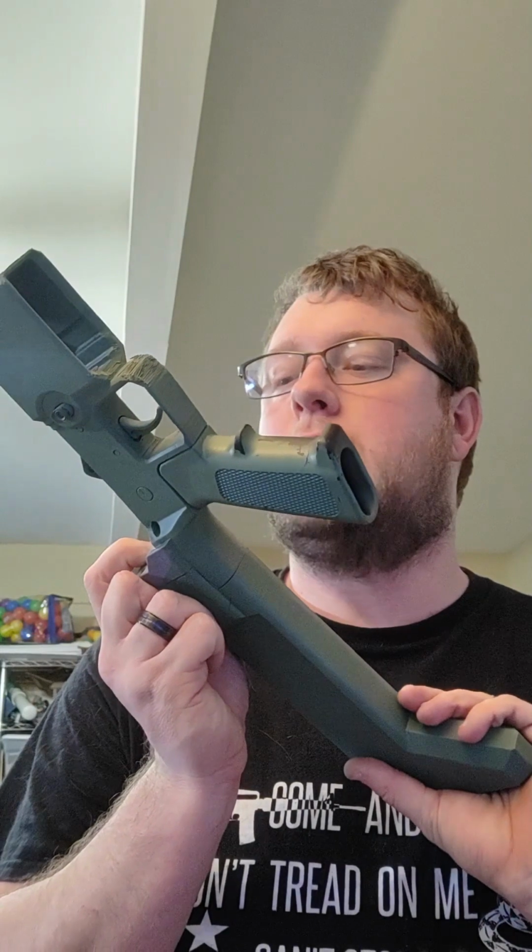All right, so first, our lower failure points observed are the rear takedown lug split. The stock design with the metal reinforcing and such was actually just fine. And I think increasing the thickness of the material here on the buffer tower would alleviate this problem.